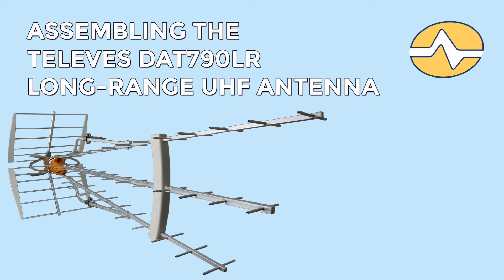It's probably going to take you 45 minutes or an hour to install this antenna. It takes a while because if you do it right, you're spending time soft fitting things to make sure that you connect them right when you're finished. The other thing I am not showing you here is proper grounding procedure, which varies from area to area. Make sure you get the most current information from your city hall and ground both the antenna and the mast.